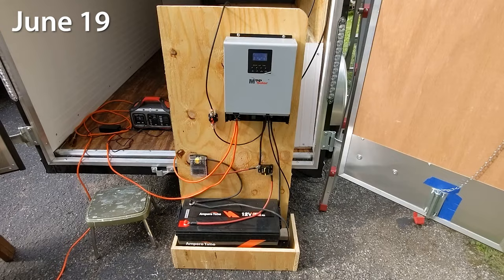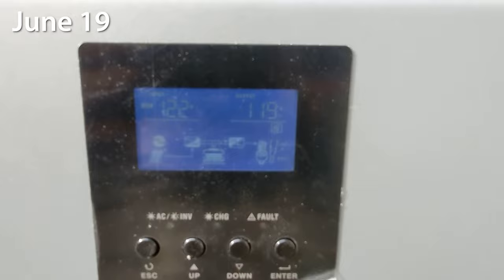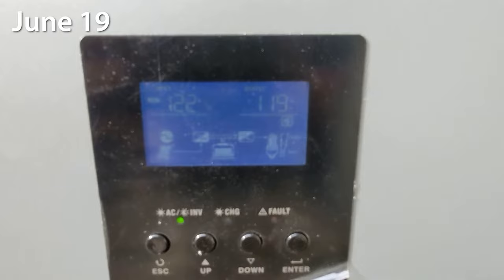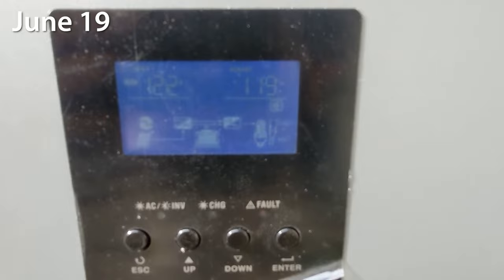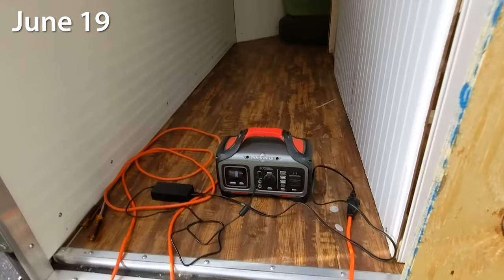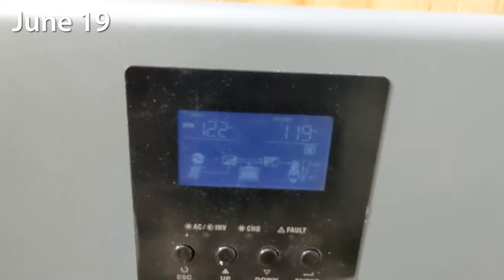Oh yeah. Okay, big electrical update. You can see here that we have this squiggly line with the circle is shore power plugged in, but it's doing nothing right now. You see the solar panel that goes into a thing that's charging the battery and helping to supply power to the inverter. The battery is also supplying power to the inverter. Right now the inverter, which is coming off one of these two extension cables, is charging my battery pack here at 69 watts, which is about the same as the refrigerator will run. I think what happens is, if the battery gets too low and I'm plugged into shore power, it will take over and bypass the battery and just power everything.